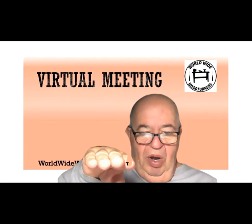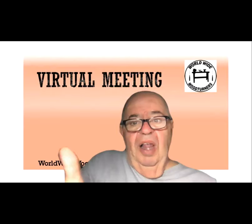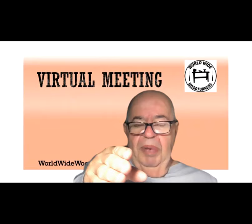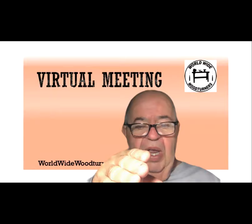And Chuck, you might find that instead of going flat into a cut with that light material, because my buddy Ronnie loves 2x4s, but he turns out great work with it because he's learned how to cut better. You see, if you go straight in with the gouge, you're plowing the wood out of your way. But when you kick it up a little bit and go in, you do a slice, and little curly cues come off. That's what you're looking for.